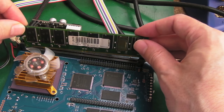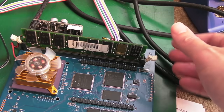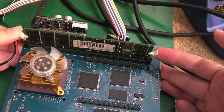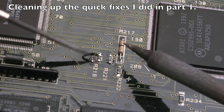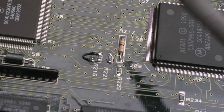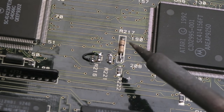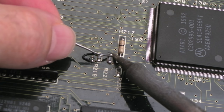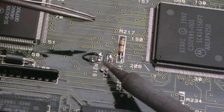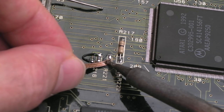That should do — it's pretty clean. Getting that back in — these DIMMs, you push them down and then the clips come up at the sides. There we go. And just for good measure, press them in. Now I've got a fudge wire here and we fitted a 22-ohm resistor because I only had 22s and it should be 33. So let's get a large blob of solder and slide that 22-ohm resistor off. Hopefully we won't lose the pads — I should use hot air really.